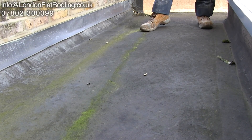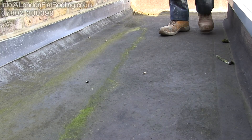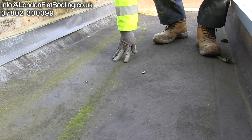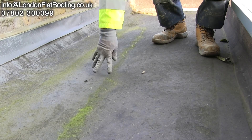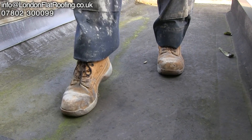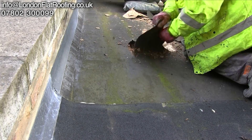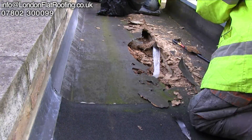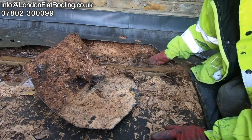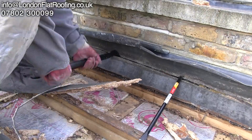This is a roof on a property which is only about three years old — quite a big roof. Damage to the roof is around the sides in two places but it's quite extensive. The decking underneath feels like it's really gone, so there's only one thing to do. We're looking for clues, trying to work out exactly what's going on. We're pretty sure it's not a roof leak. When we start picking this out and having a look, we can see it's really drying in most places but is wet in a couple of places, especially up against this wall.